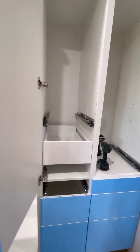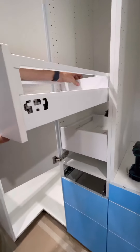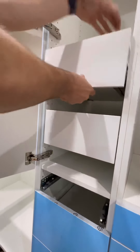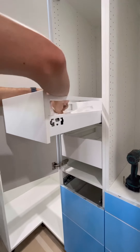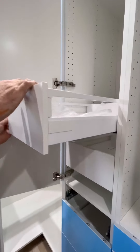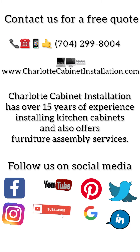Now you take them off. Take it, set it about halfway back on the track, set your drawer down, push it in, it will snap, and your drawer is on. You're good with interior drawers at this point — just close these up and you're finished off with your cabinet. Interior drawer front — thanks for watching, guys.